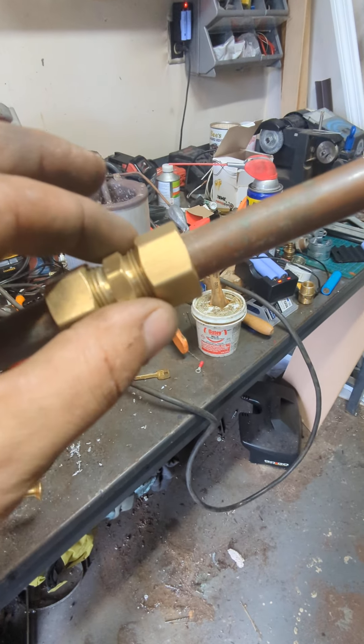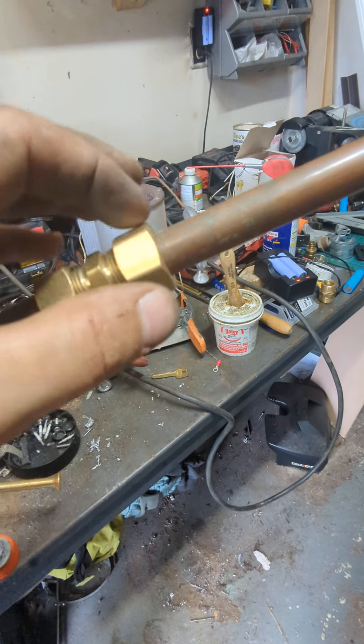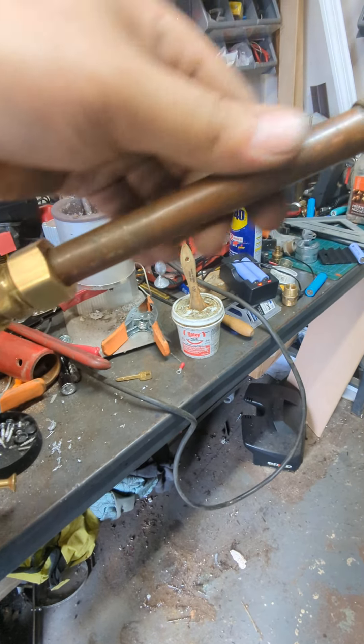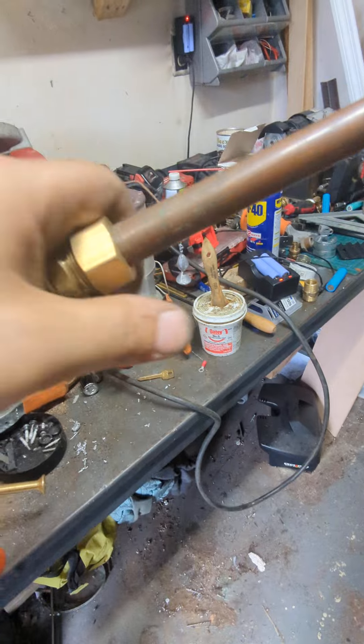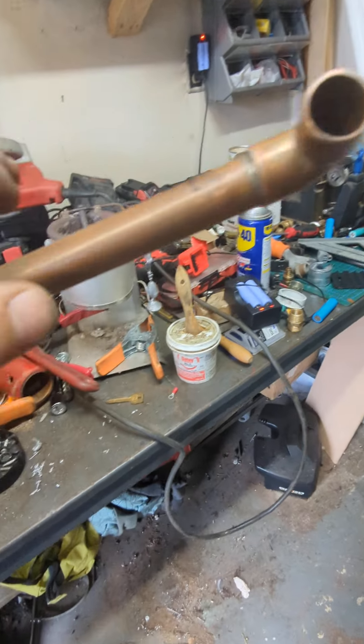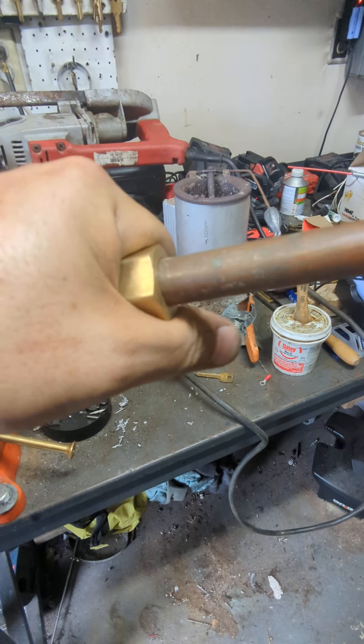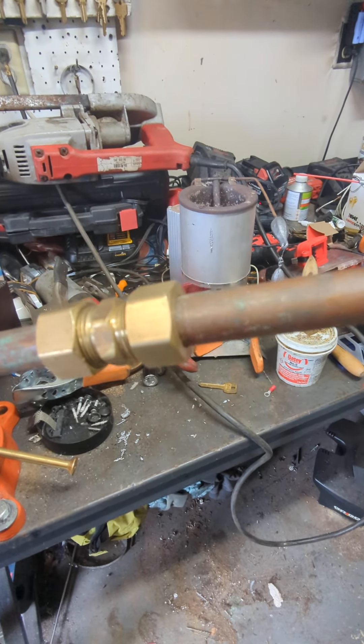The only thing you need to know is that this is actually a 5/8" union because it goes by OD. So half-inch plumbing pipe needs a 5/8" union, because some pipes are measured by the inside diameter and some by the outside diameter. But yeah, the original SharkBite — they work great and they don't care if the water's flowing.